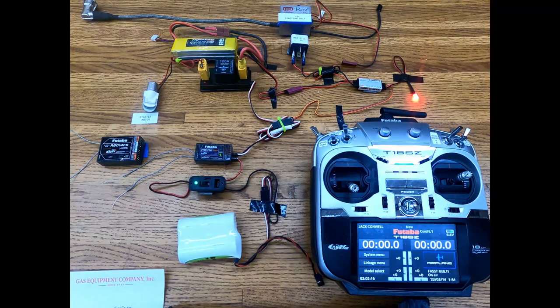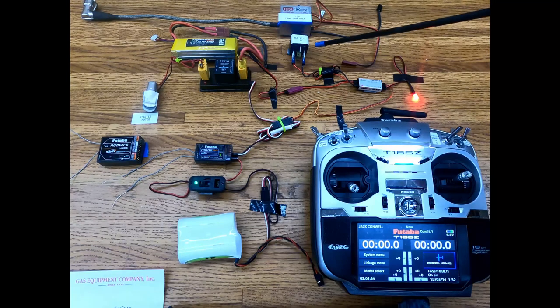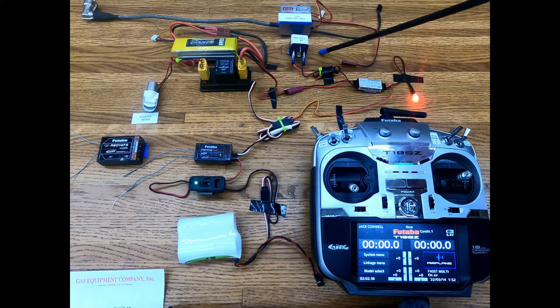Hope you enjoyed it. If you do use an ignition module, make sure that it is 12 volts or get your voltage hooked up right to it. If you are using a mag and you want a mag kill, make sure it is normally closed so that if you lose voltage to it, it will kill your motor.